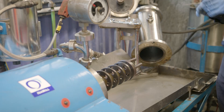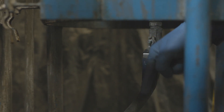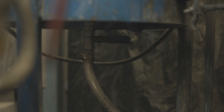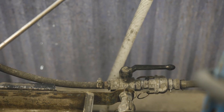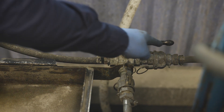First, check the mill is isolated and inspect the interior components such as discs, spacers and rotor. Make sure all valves are in the correct position with tank A open and tank B closed. The flow diversion valve should be pointing back toward tank A with all discharge lines directed into tank A.